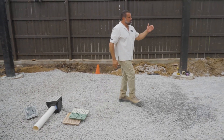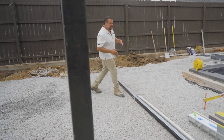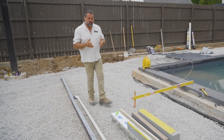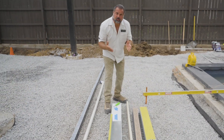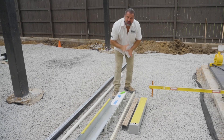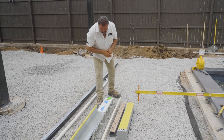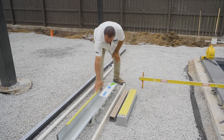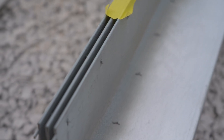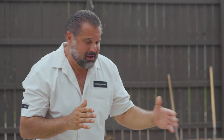We can also use channel drains transitioning from our pool coping to the eventual patio area. We can start with a slot style or trough drain — that's this one right here. This white lid is left on during installation, and we put some protective tape to keep debris out. Once installed with the right pitch for positive gravity flow to a dry well or a pop-up drain, we take these lids off and the metal unit goes on top. It's been textured painted and is one-half inch wide, making it ADA compliant, so water can run down into it.